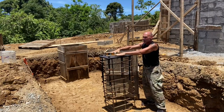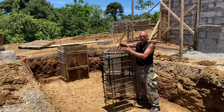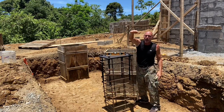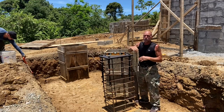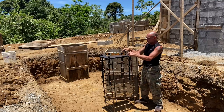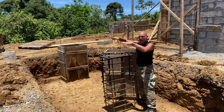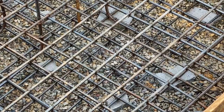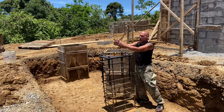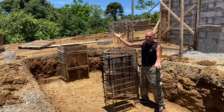Once this is done, we'll have some really massive I-beams. Those I-beams will go right here, welded to this base, and will go way on up to help support the rest of this house. These plates rest on these massive rebar supports — six huge rebars — and all of the weight of the house sits on top of this plate, which then distributes the weight through those six rebars down through the massive rebar support system in the concrete. This way you don't have all your weight in one spot; it redistributes throughout the entire footing, keeping your house extremely stable.